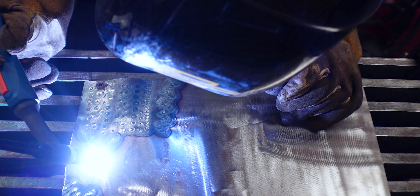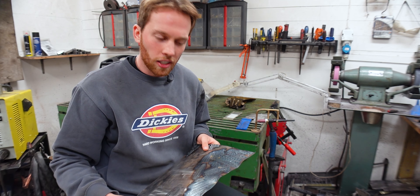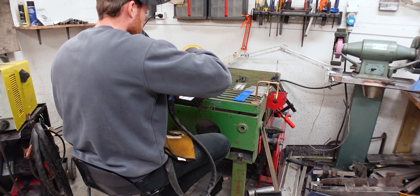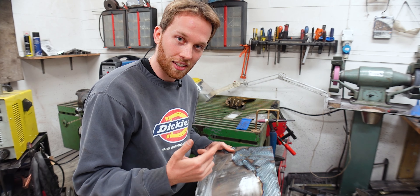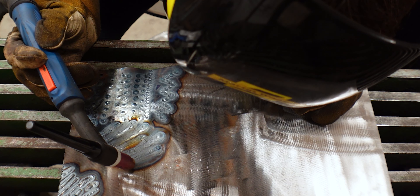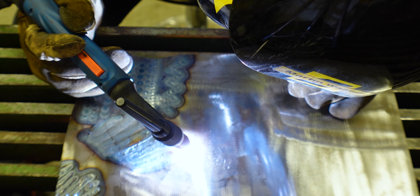What I found helpful is to first initiate a good weld puddle and then just focus on the puddle. That's what I did with the second one and it's the one I'm most happy with. In the beginning I struggled with the warping of the sheet metal and dipped the tungsten on almost every line. But overall they're much more consistent than last time. What helped was to first create the puddle, then start moving it, and just watch the outside edges — that made them look pretty consistent.